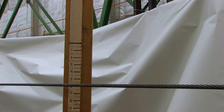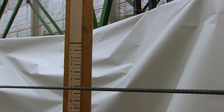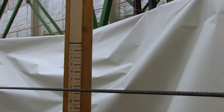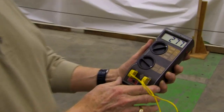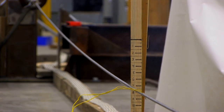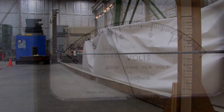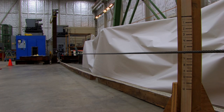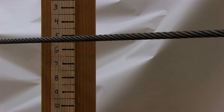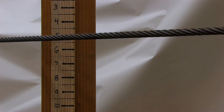You can imagine the same effect on high voltage power lines during a hot summer day when homeowners and businesses are cranking their air conditioning. Conductor like this iron wire could permanently elongate if it gets too hot. But in most cases, the line returns to its original shape and length once the current goes back down and the conductor cools.